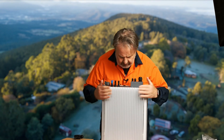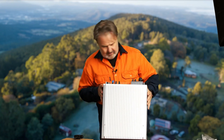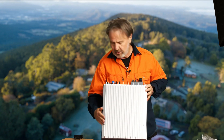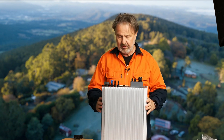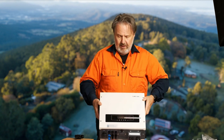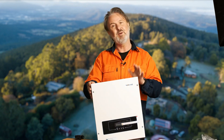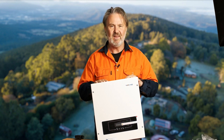Looking at the back of the unit — there's a nice big heat sink, as you would expect. It's passively cooled; I can't see any fans or vents, which means no moving parts. The reliability of something with no moving parts is generally really high. All in all, a very conventional-looking inverter, but with that extra power rating of seven and a half kilowatts — that's pretty nice. I'd say this is a winner if you've got room for ten kilowatts of solar on your roof. Thanks for watching.